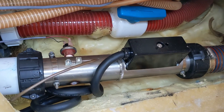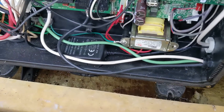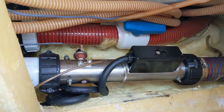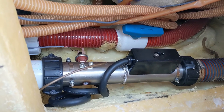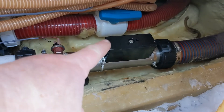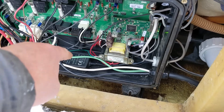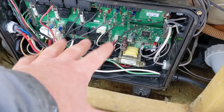Put the new heat tube back in — they're all running again. I'm going to test the voltage and the amperage. I tested the voltage and we had the heat tube melt. I had voltage but one of the lines was off underneath that box right there, so having voltage doesn't mean it's okay. I had to test the amperage. Last time I had zero, so I should have around 23 amps now.